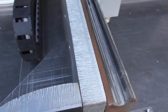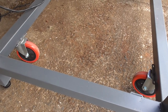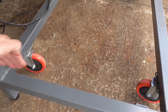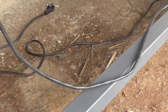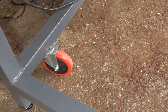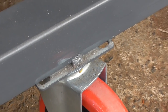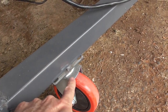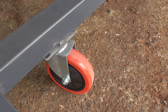I'm really glad I changed the caster wheels to the bigger more sturdy ones, because now that the full weight of the aluminium table is on there, even these ones are starting to get a little bit stiff. When rolling in a straight line it's pretty much fine, but when they need to turn around they get a little bit sticky — especially on this rough floor. I'm also starting to think I should have welded fully along the edge there instead of just a little tack, because the arm of this piece has started to bend sideways when turning.